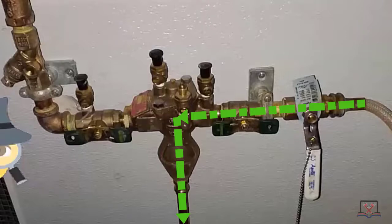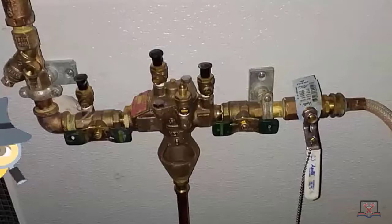They can be a pain in the ass. Fluctuations in the water distribution system in a building — the valve will start doing it. It thinks something is wrong. If it's feeling fluctuations on the downstream side, this is designed for a specific pressure drop. If it feels like a 5 psi pressure drop on this side, it'll start to dump.